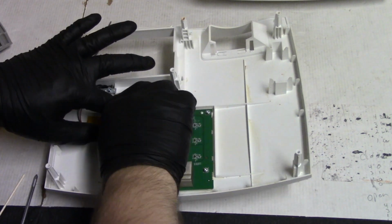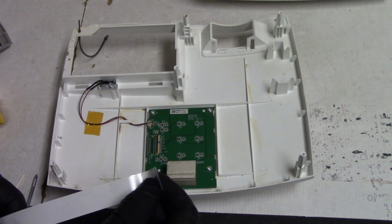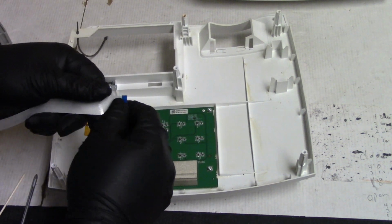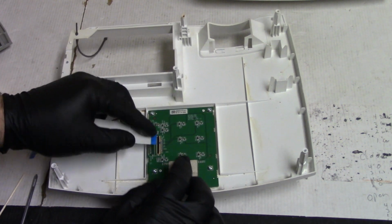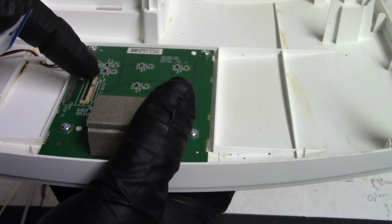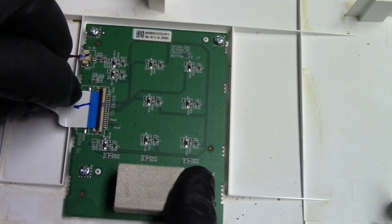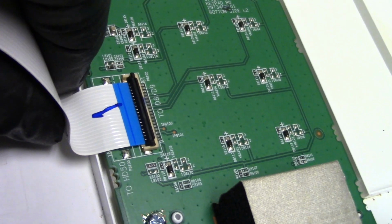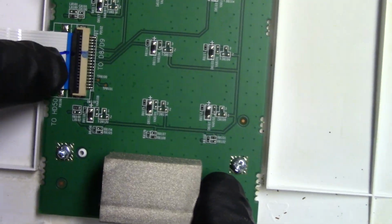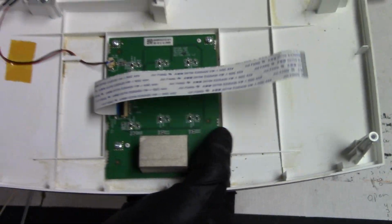That's good. That wire back under there, and we'll plug her in. And then we know these are clean, and that was plugged in there, and that's going to go up, so that goes this way. And again, for these kind of connectors, you want to make sure that latch is up. And then we slide the wire in, so that it goes underneath those little teeth there where the connections are. Then snap that down. You'll know if you're in far enough because that line that's on that plastic will be about lined up with the latch. So that's good. This is ready to go back on.